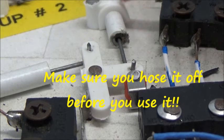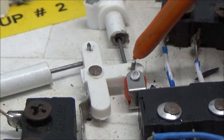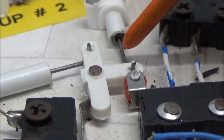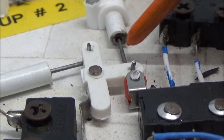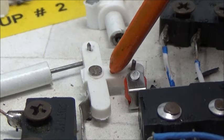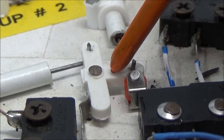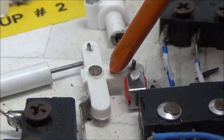You'll also need some cable clips to hold the cable down if you're using cable. It depends on your application — you might use a heavier gauge wire and not need the cable at all. Wire over short lengths won't bend under pressure, but under compression is the main thing to watch: nearly all wire is good when pulling, but that's when it will bend under compression. So you may need to experiment. A couple of hundred tile spacers for a couple of dollars — about a cent each — compared to possibly four, five, six dollars for one bell crank from the model shop. It's not the prettiest method but it's certainly the cheapest.